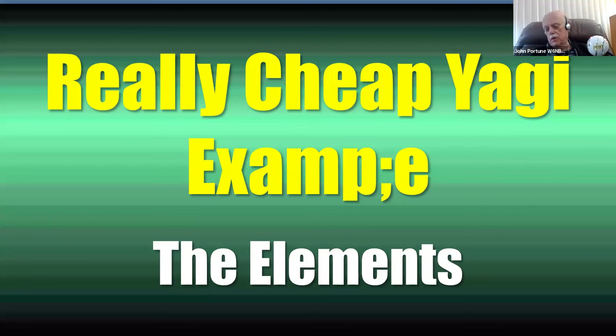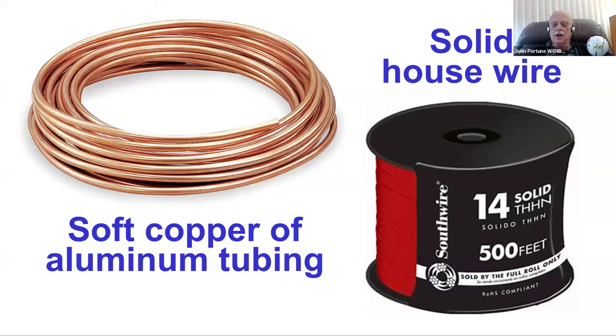First of all, the elements. What are you going to build the elements out of? What do I recommend? And sorry for the typo there, the semicolon instead of the L. Don't build your elements out of these. That's what most hams might think to build the elements for a homebrew Yagi out of, but I don't recommend these materials. Don't use soft copper tubing or aluminum tubing if you can get it these days, although you can get it at an auto parts store as fuel tubing.